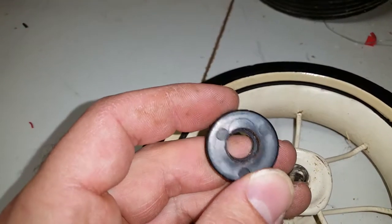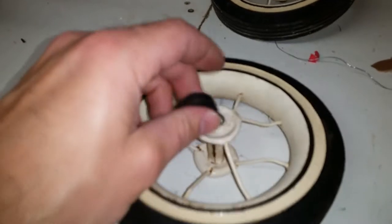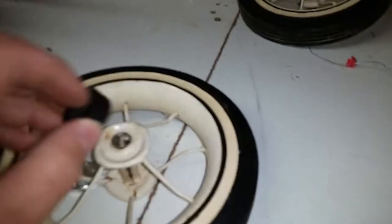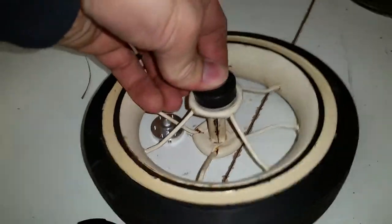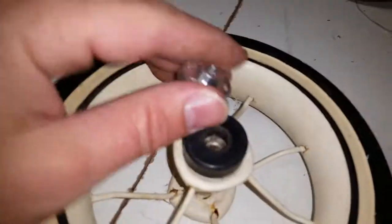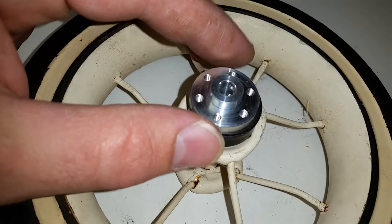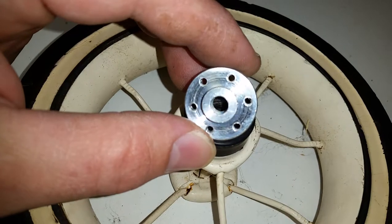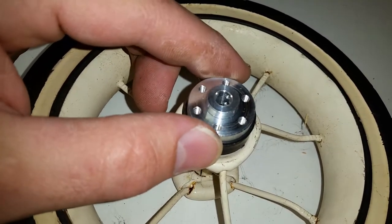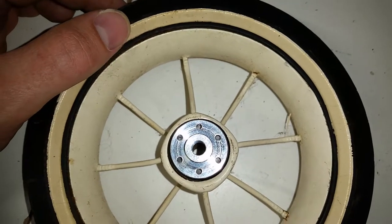What I did so far is take these to the drill press to make mounting a little bit easier. I drilled out a little spacing so instead of fitting flat on top, you can force the hub on — there we go, a nice little pop and it fits pretty good. I've never added hubs or motors to something that didn't have a motor before, so my biggest worry is getting wobble on the wheels. I ordered a 60 RPM motor and I think I'll run it somewhere between 30 and 60 RPM.